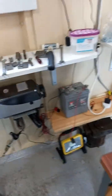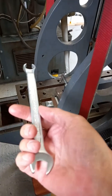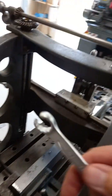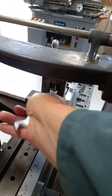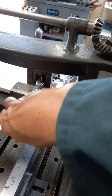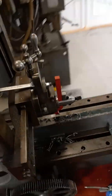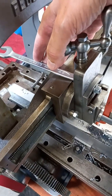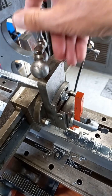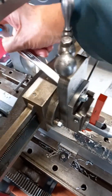I've got a new tool which I bought today — at the tool supply place I bought a cheaper 9/16 combination spanner and I've cut the end out so that it now fits over that nut, so I can tighten and slacken it properly. So we can put a cut on. We'll go in half and then another quarter and lock that. I'm going to spot-face this at the back here so that it sits down on a flat face.